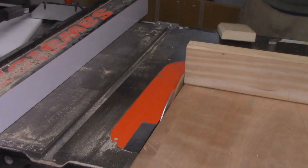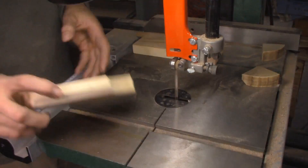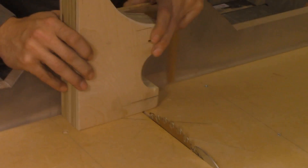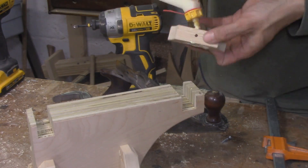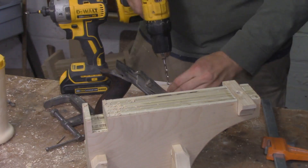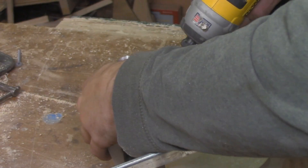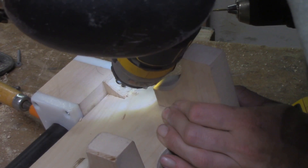The sandwich of plywood is very rigid and it's going to be good at resisting force back and forth, but it's quite narrow, so it's not going to help me resist forces side to side. So I took a piece of hardwood and created a couple of legs that would stretch out to either side. Then I notched out my plywood rectangle so that I could integrate them in with screws and glue and create a really solid foundation. Then I notched out the top of the tailstock and added some hardwood strips to accept the blocks that house my tailstock ram. There are several points where the whole thing is held together just with screws — that's intentional because the tailstock needs to be adjustable so that it can be at the correct height and aligned with the headstock.